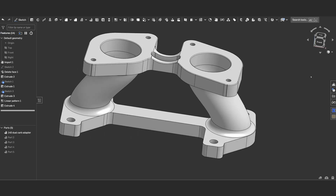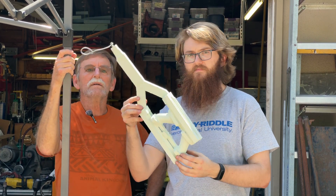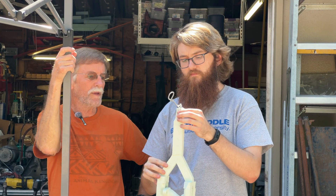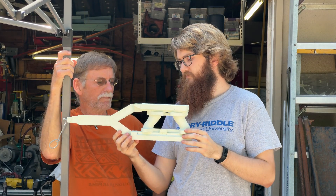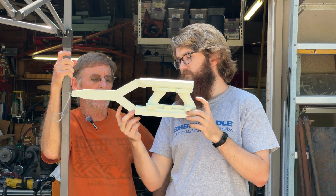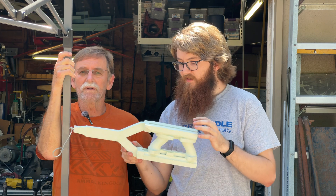It's all in flow — it's lofted. It's all dipped in the refractory and got the gating on it. It's just ready to cut the wood off the top sprue and put it in the sand. We're going to cast this, about five pounds of aluminum. Pay attention because we've got new crucible tools to pick it up and pour it with, instead of using the cheap little pliers.